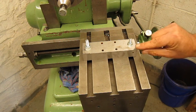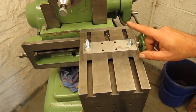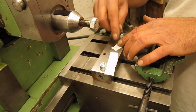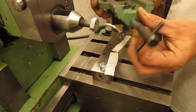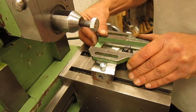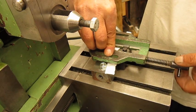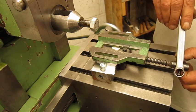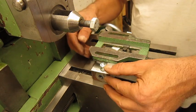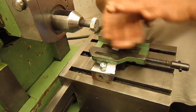All that's left to do is mark a little line here, take it off again, and cut the studs so they're not in the way. I put cigarette paper here and another one here, then put the vise in place. When we feel this paper is stuck, we know that the vise is flush with this block.